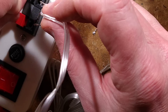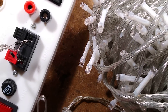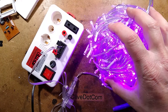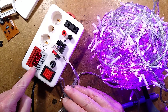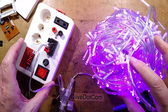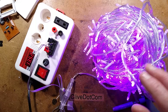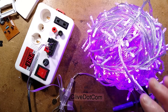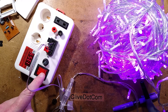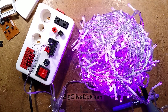The power is off at the moment. I'm going to stuff these in — here are the LEDs. Let's turn it on. The LEDs will just be static. The power consumption is 13.5 watts and these are not being run at ridiculously high current — the resistors in series are not being overdriven, which is nice. Some sets do overdrive the LEDs. I'm going to leave them on because they're quite nice, even though they're still not safe.